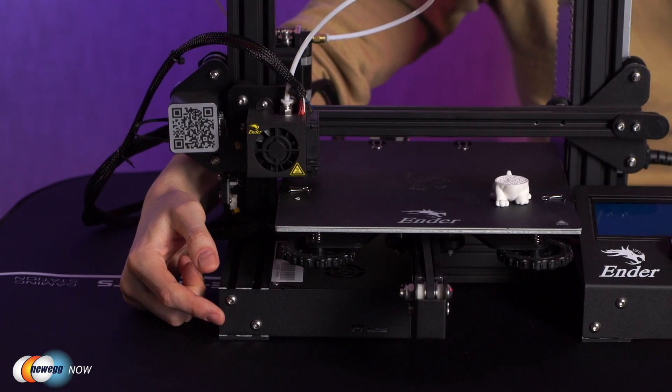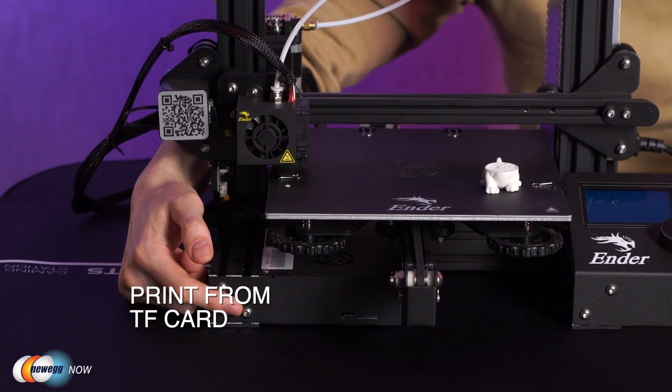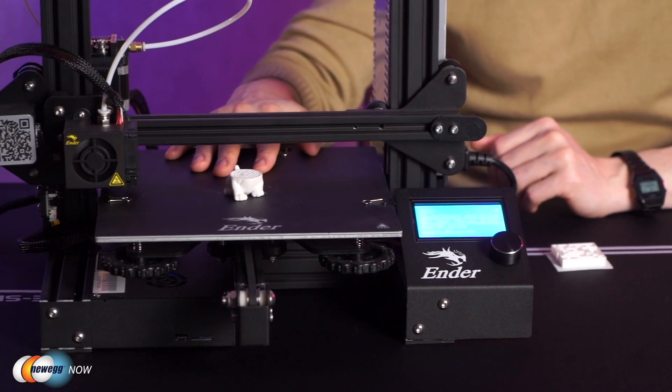You can find other premium 3D printable models at Thingiverse and MyMiniFactory, or even design your own model to print. You've got a whole community creating things together. All you need to do is find a CAD file, put it onto a micro SD card — also known as a TF card — pop it into the micro SD card slot, and you're good to go. The hotbed can reach 110 degrees Celsius in about five minutes, so that's really fast heating. It also has resume print technology that lets you resume exactly where the extruder stopped in the event of a power outage.